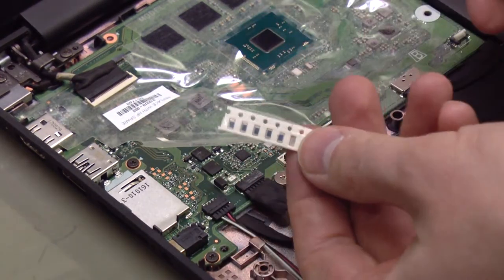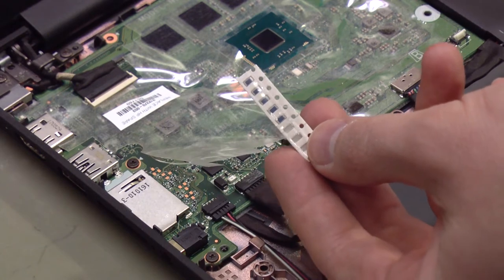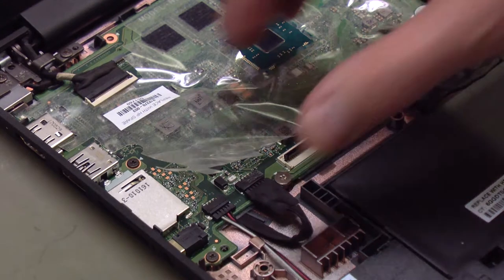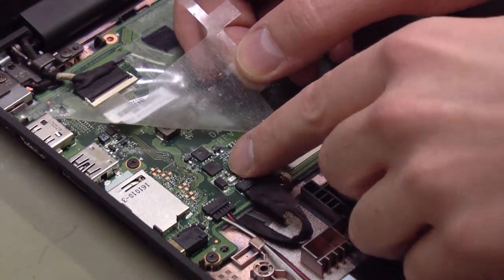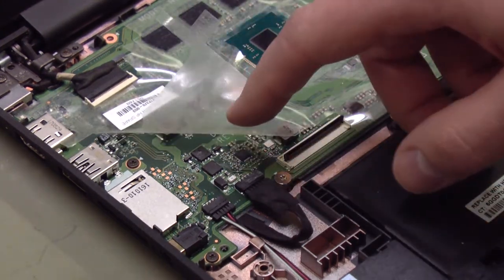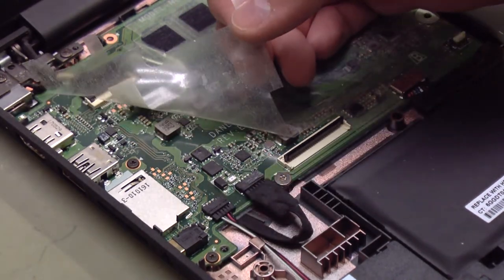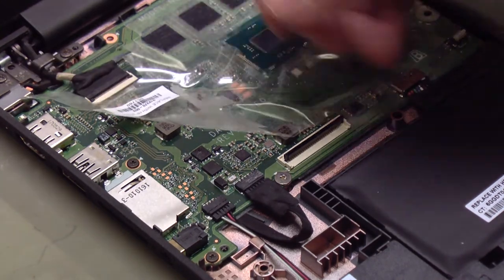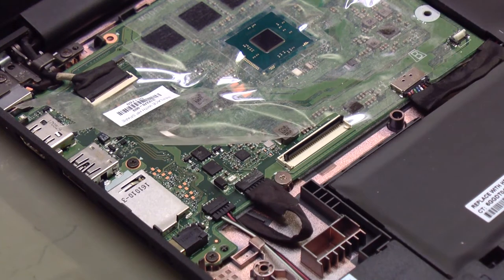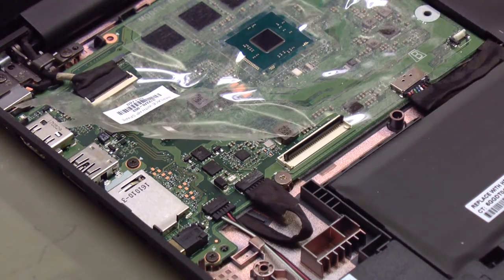Here's a pack of new fuses — they're tiny. I'll put a link in the description of where I found these fuses, but they're just a 5 amp 1206 fuse, at least I'm pretty sure they're 5 amp. The old fuses have a little tiny letter N, like November — you might not be able to see it on the video. I forget what manufacturer uses that lettering code, maybe Littelfuse. The PC shouldn't draw that much current, so 5 amps seems reasonable, if not maybe a little high. But that's what we'll put back in.